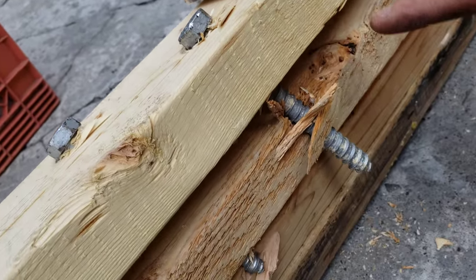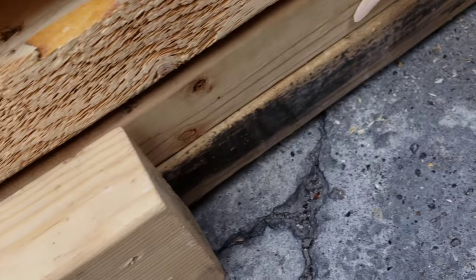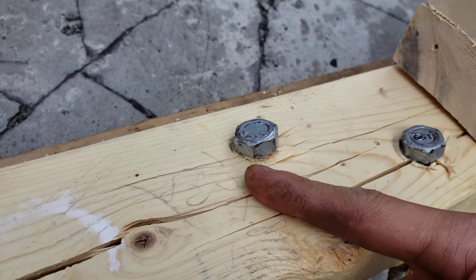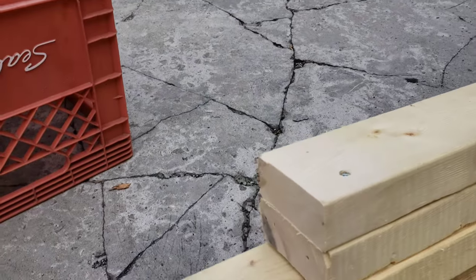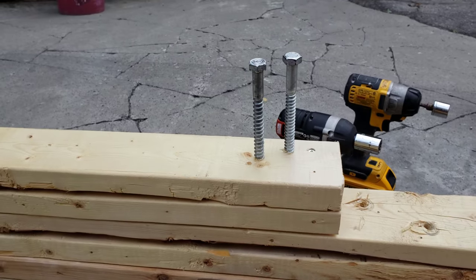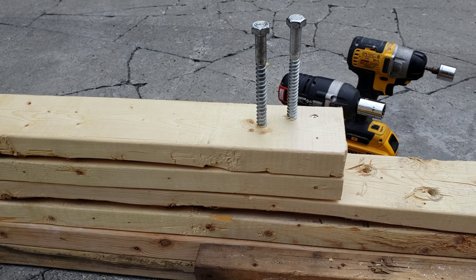That's a bust. So the Rockwell went through real fast, but it's probably because it went sideways. Dewalt didn't go sideways until the last minute. The wood started to split, so I think there will be a problem too. Might have to pre-drill the wood, huh? Let's see if I have a drill bit that's long enough. Okay, I pre-drilled two holes. Hopefully that's gonna prevent the wood from cracking. Let's try again.